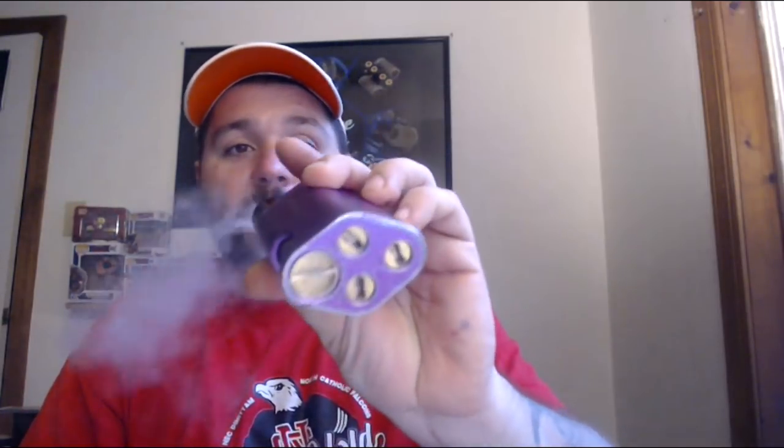This is good for low builds. Triple parallel. Not noisy cricket, do not do noisy cricket with a 0.08. That's a horror. No. Unless you got the noisy cricket too, it'll work in parallel mode, but no. Noisy cricket is a big no-no. That's a series mod. Noisy cricket, you have to do 0.33 or higher. But anyway, V2 will work in parallel mode. I don't even know if it'll work in potentiometer mode. Definitely not in series. In parallel, yeah, it'll work.